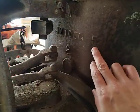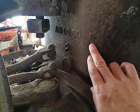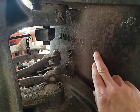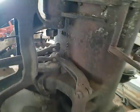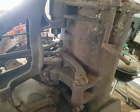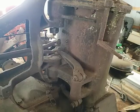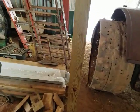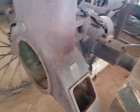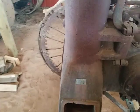I know Dave Harrington wanted to know this. It's a dash five, Dave. I guess you can roughly, I emphasize roughly, date the tractors based on that if you don't have the serial numbers and whatnot. Because like many aspects of tractors, like the 2035 has a block number that you can roughly base the age of the tractor on, the casting number if, say, you don't have your serial number tag.